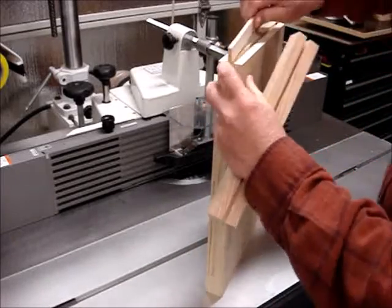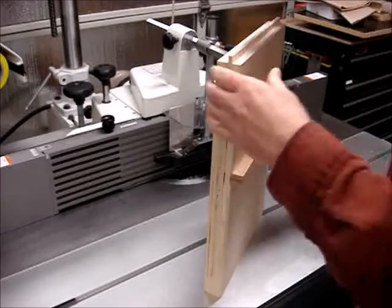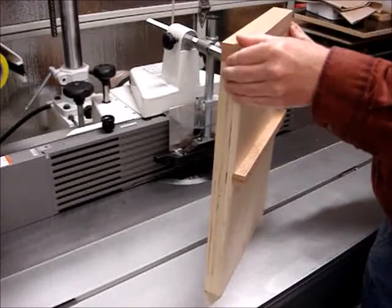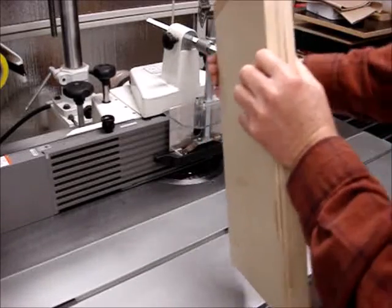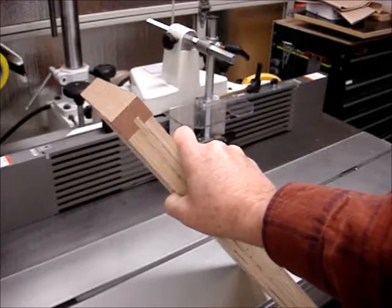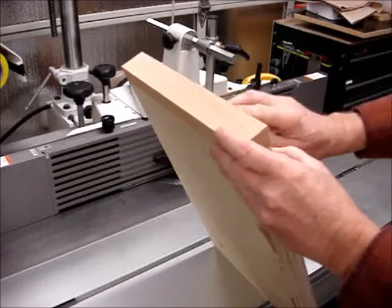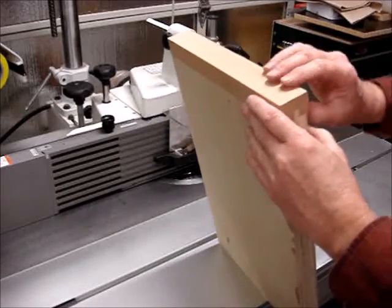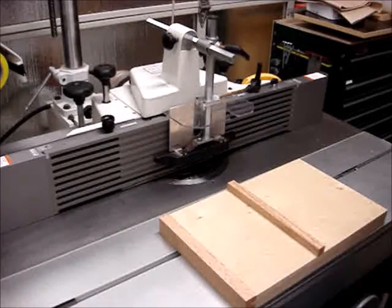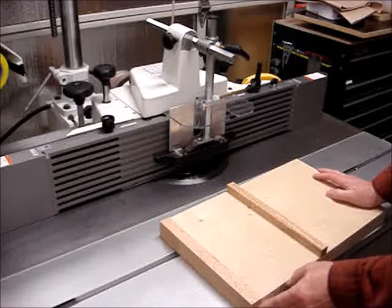Let's see how we did. Oh wow, it's a beautiful fit there — and on this side. I am closed up completely and it doesn't seem like there's hardly any gap at all in that spline joint. I'm perfectly flush on this side, and I'll use a lipping planer to mill the excess off. That's the adjustable groover — and those adjustable groovers are my most used shaper tooling.